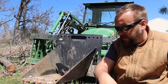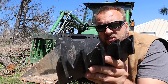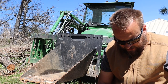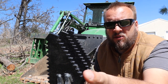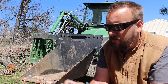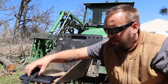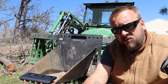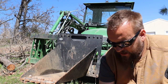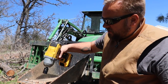I've actually shown these teeth in another video. You've got the standard tooth which works well, then the heavy-duty tooth which is reinforced by having the cutting go in both directions, then a ripping tooth with serrations on it, then a heavy-duty ripping tooth with cutting edges in both directions and serrations. We also have a trenching blade — that's for digging a two-foot deep, 12-inch wide trench, like for a shallow water line or a swale. But we won't be using that one today. I think the first thing I'm gonna do is put on this heavy-duty ripping edge; it looks like it's going to be really quick and easy to install — just four bolts.